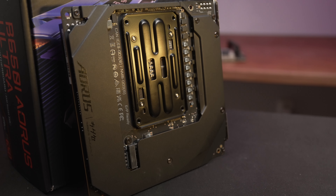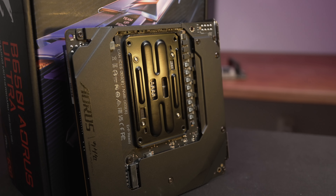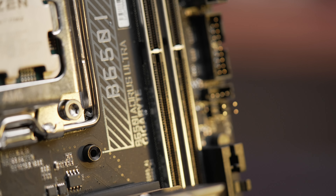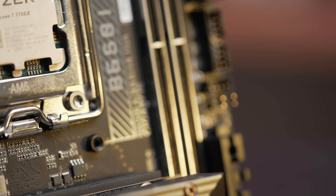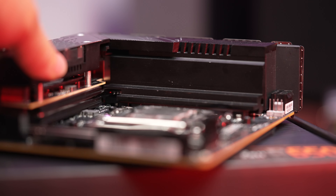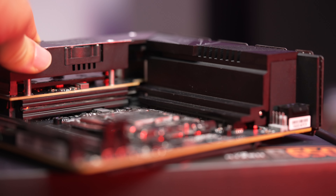This board is designated as Aorus Ultra level — one of Gigabyte's highest tiers — but there are no debug LEDs on this board. The B550 ITX doesn't have them either, which is perhaps excusable at mid-range, but for Aorus Ultra level that's a huge omission. The MSI board has a very convenient set of debug LEDs, which is especially helpful with Ryzen 7000's longer post times — if your system is stuck on the memory training phase, debug LEDs reassure you it's still working. Not having that is a huge omission.